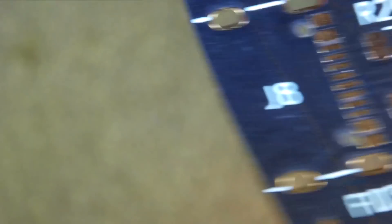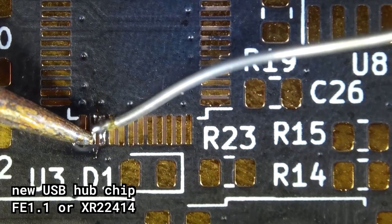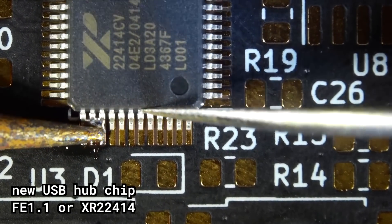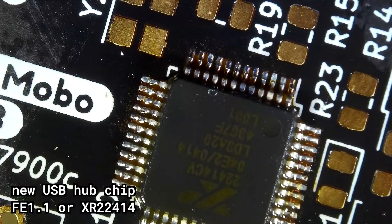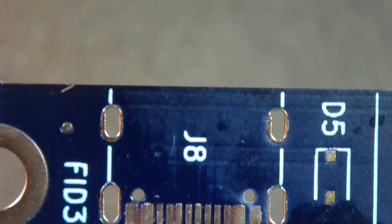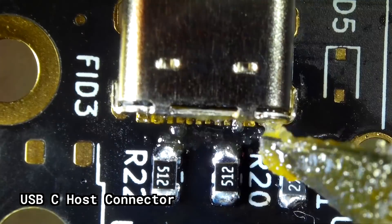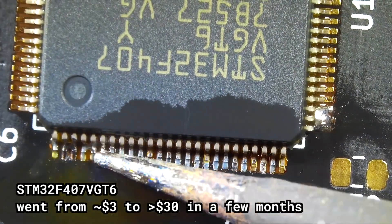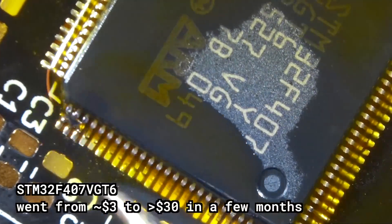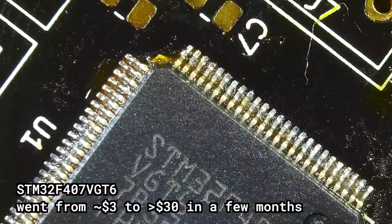There's a lot of stuff that's changed from Revision 2 to Revision 3. The new USB chip allows for concurrent TT, so it should work better with a lot of cameras on the USB hub. It's also been made compatible with one more max linear chip, not only the FTDI FT231. The switch to USB-C seemed a good thing to do because more and more boards are switching to USB-C and people will start to not have micro-B cables. The silicon shortage is a little bit harsh right now — it's hard to predict the future around chips, so it's hard to pick them.